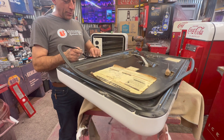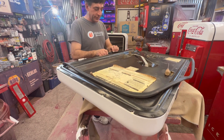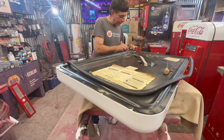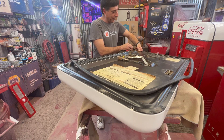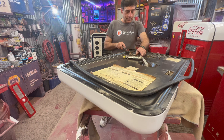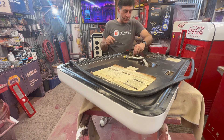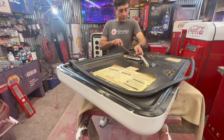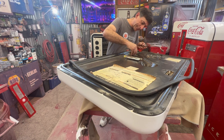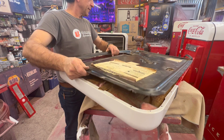Really if it wasn't for that bottom one I could reuse this top. So if you're taking yours apart and trying to make that decision, don't go in there and break everything off - be cautious with it. Because there's going to be a day that maybe we can't get liners anymore. We may be taking this arm off just so we can try to save the liner. There's a little clip that comes off - the arm should come right off like that. Don't lose that clip - I usually stick them right back on. That's a lot better.